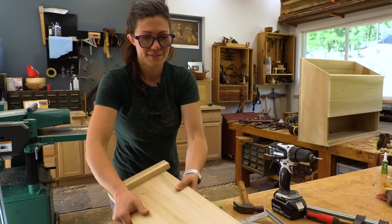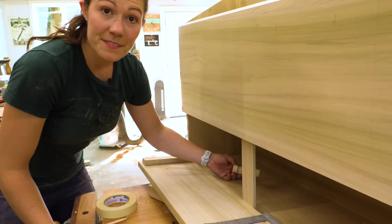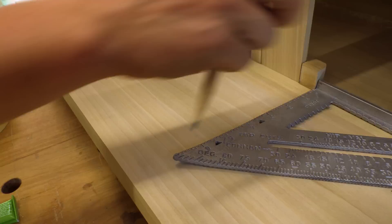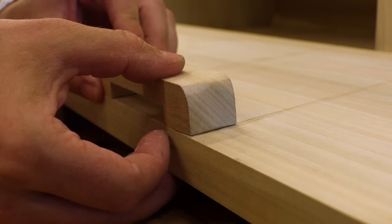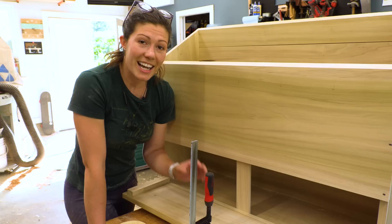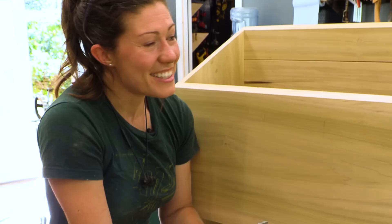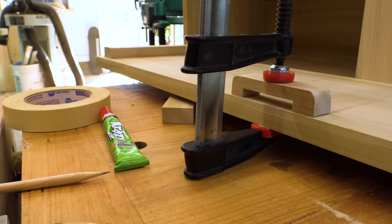Moment of truth — hey, that's pretty cool! I love this part in projects when it's almost a whole piece. The last step is to attach the key holder onto this piece. I place it in here, carry over those lines, apply some glue, and clamp it in place because we want this to have a really good connection. The nice thing about this and what makes Krazy Glue different from other traditional wood glues is that it dries in minutes rather than hours. Instead of having to wait 30 minutes for traditional glues to become tacky, this one becomes tacky in seconds and is fully bonded within minutes.